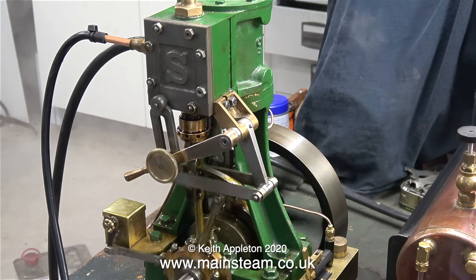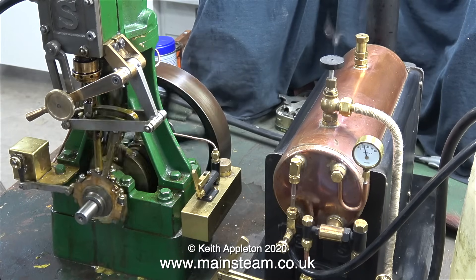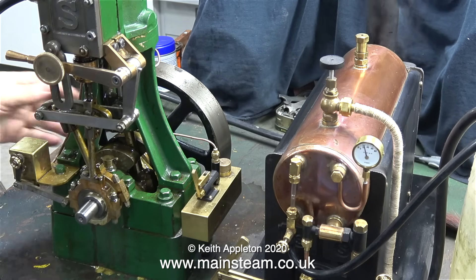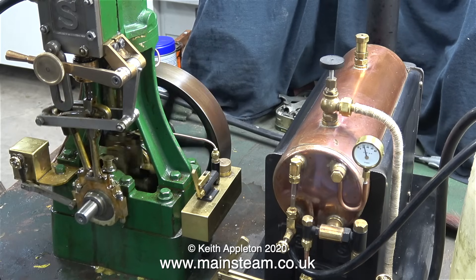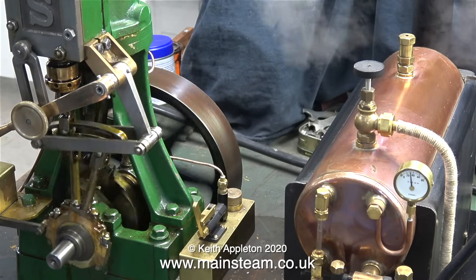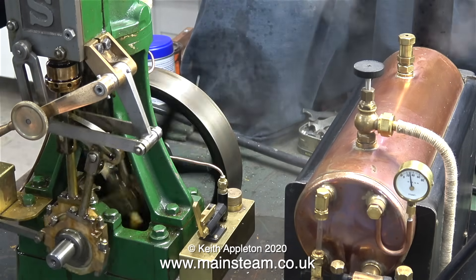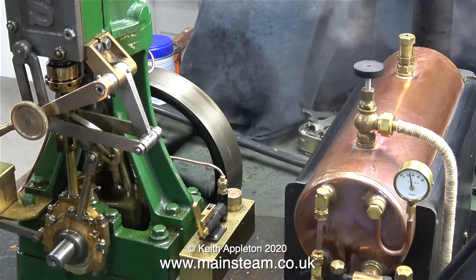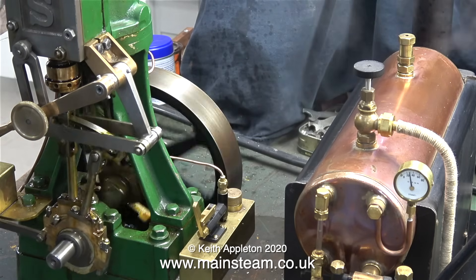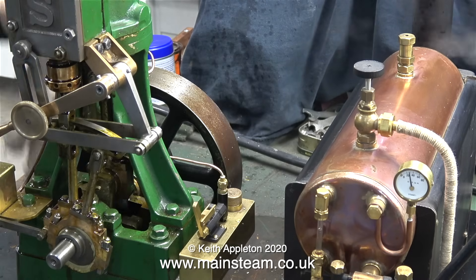You will notice now that the engine isn't knocking quite as badly. But as soon as the pressure drops down to about 20 pounds per square inch, it does start to knock, and this gets worse as the pressure drops. This Stuart 5A has a cylinder that is 2¼ inches in diameter, and my old Stuart 504 test boiler has a boiler diameter of only 3½ inches. The knocking stops when I open the drain cocks, because the water pushed into the steam chest from the boiler is very saturated and wet — so at each end of the piston is a pool of water, and that's what the knocking is.